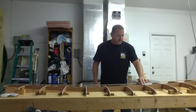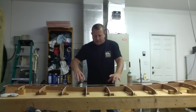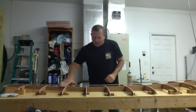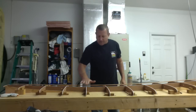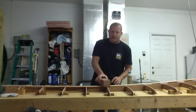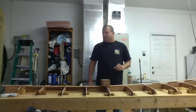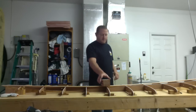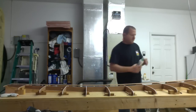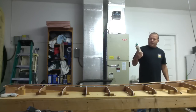There are a lot of different ways you can hold your plank down. You can use clamps, or you can run some plastic tape over the first one. On the first one, what I usually do is put something heavy on each rib — just kind of put my board down. I lay a brick right there on the edge and get this first stringer nice and straight and solid. Remember: Titebond 3, ultimate woodworking glue. It's waterproof. Don't use the water-resistant — use the waterproof.